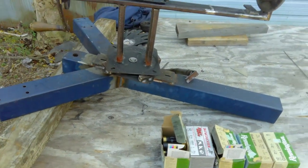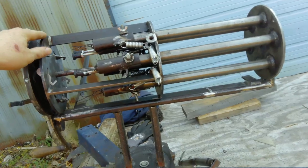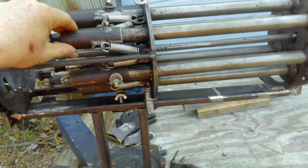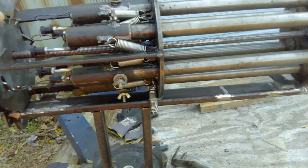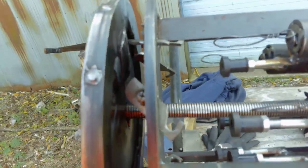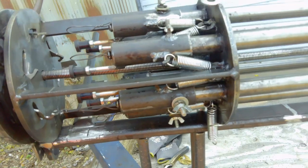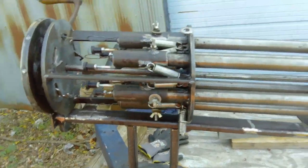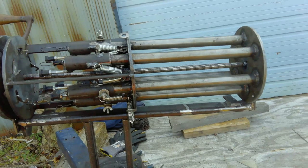Here she is, bottom to the top — boom! This is a six-barrel cranked Gatling gun. The way it works is basically like a slam-fire gun, but it's spring-operated with a little latch here that hooks to this. There's a wedge back there, and every time it turns, it will hit the wedge and release. It took me three different full designs before I got this right — that's why it took so long.